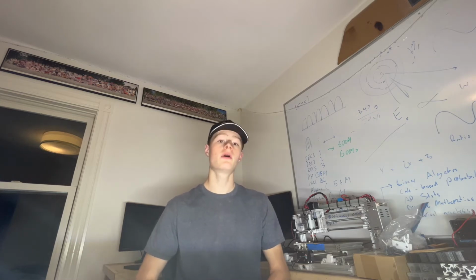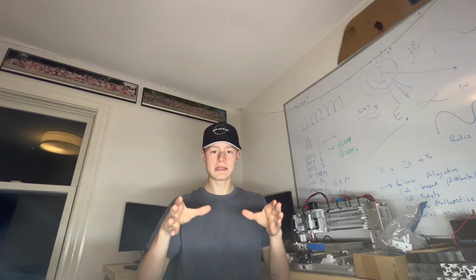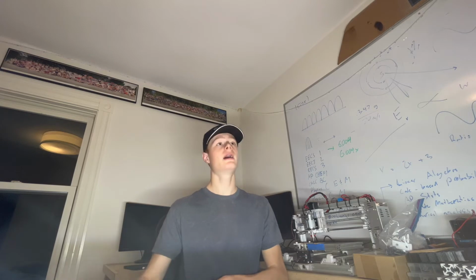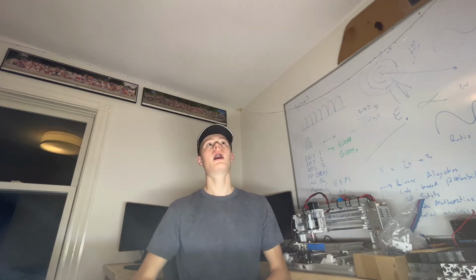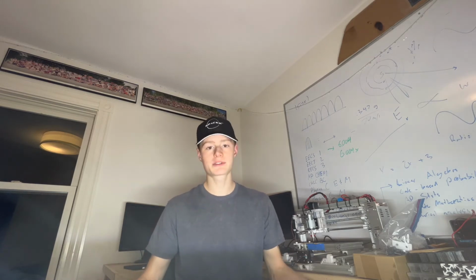Once we've designed our frame, we need to add on three independently moving axes that'll enable the drill bit to move throughout any point on a 3D plane. Like most 3D printers, I'll be using what's called a stepper motor to actually control my axes. Stepper motors are commonly used because they allow for a very simple and yet precise movement at a very, very low cost. They get their name from the fact that the motor moves in individual increments, maybe 160 increments per revolution or 160 steps per revolution.